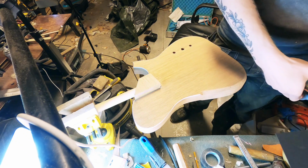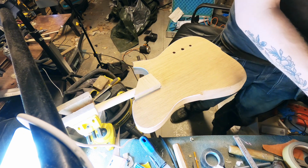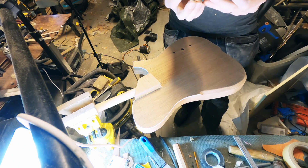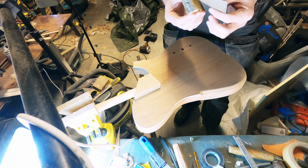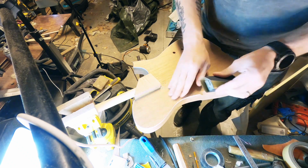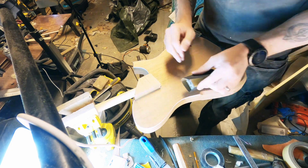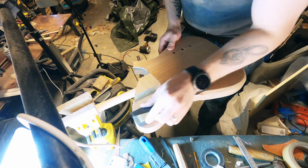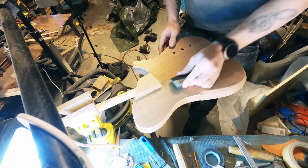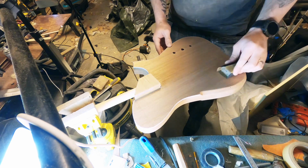So I'm going to cut it and I'm going to put it around one of my flexible sanding blocks. I'm not doing any leveling at this point. I'm just kissing the tops, you know, where the fibers stick up. I'm not putting pressure on it. I'm just doing the top and the sides now for the epoxy. And I'm going to let that dry. And then we'll do the back in one as well.